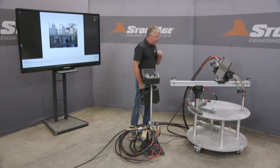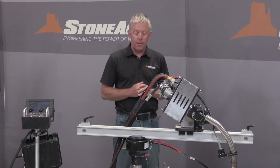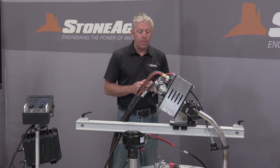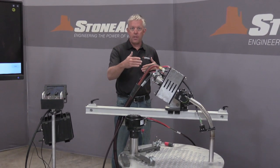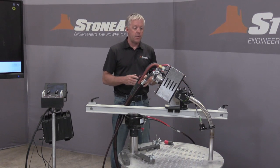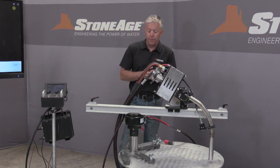The next major part of our system here is what makes this system really unique in the industry and why it's not available from any of the other manufacturers. So previous to the Compass, other manufacturers had offered some equipment where they're literally putting a square frame in a round application. And when you do that, you're going to be left with tubes on the outside of your square box frame. So then you're required to come in afterwards and use high pressure hand lancing to go get those tubes done. Very inefficient, and of course defeats the purpose of what we're trying to do here, getting our operators' hands off the high pressure hose and out of the work environment.